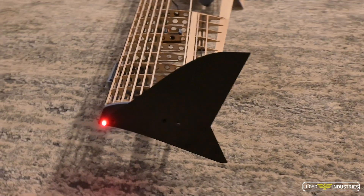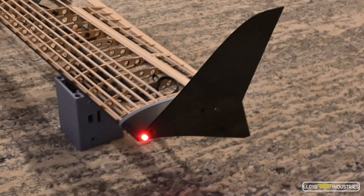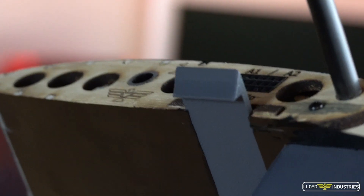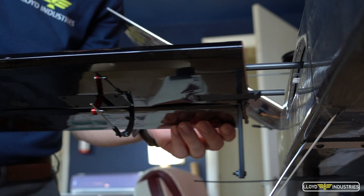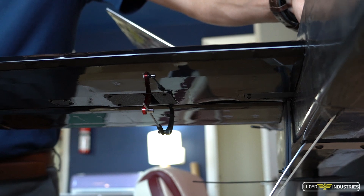For now, I've outfitted the tips with a simple winglet and a cool nav strobe light sequence that I was able to program on an Arduino Nano with the help of ChatGPT. The wings attach to the fuselage with a little clip that satisfyingly snaps into the opening, keeping the wing and contact pins secured. The carbon fiber tubes each fit into each other, giving a smooth assembly and disassembly process. Now we iron on the monocoat covering and it's ready to fly.